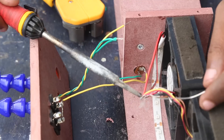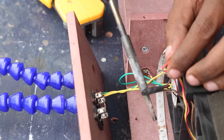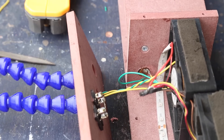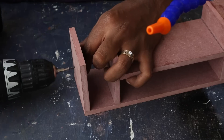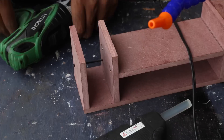On the side there is a power jack where I connect my 12-volt 1-amp DC power supply. The connections run from the DC jack to the switch, and from the switch to the fan and the LED light.